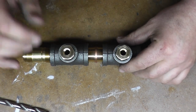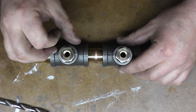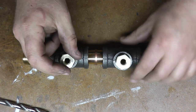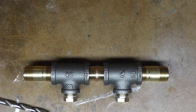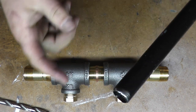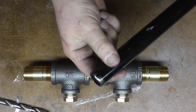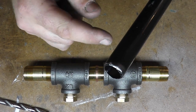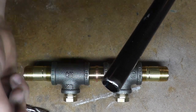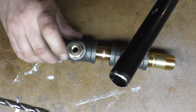hold me perfectly well. And what we'll do is we'll take this one, or one of them, we'll make a threaded piece that'll thread in, and then we want to adapt to, where's that pole? To the inside here of that extendable pole. So we'll get a piece that's a nice snug fit inside here, maybe Loctite it in, either that or as you can see they did here, maybe peen the end or crimp it onto there, some way to attach just an aluminum slug in here by 3/8 thread